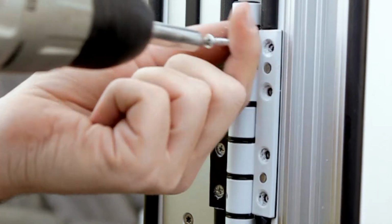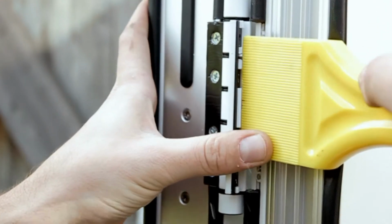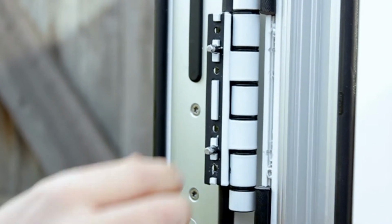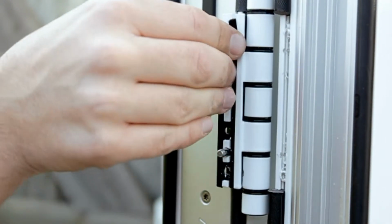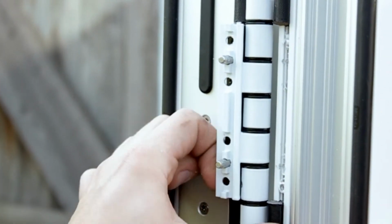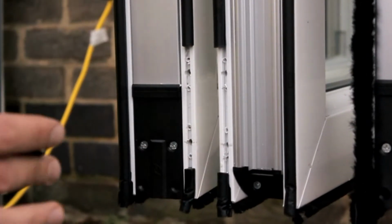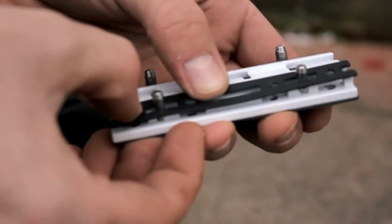Any vertical door gap adjustments needed can be carried out with the use of 1mm Liniar packers. You can remove or add these packers from each hinged point in order to give you plus or minus 2mm of adjustment where you need it. Remember to equally space these packers on the hinge and add no more than 4 in total.